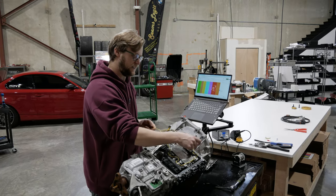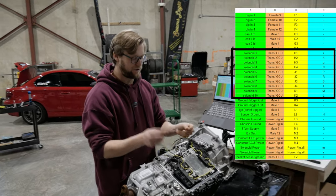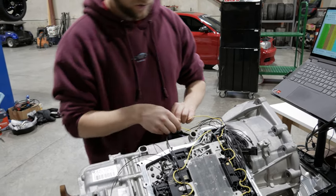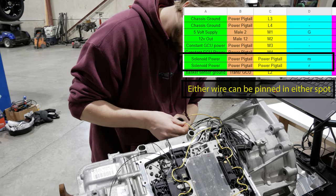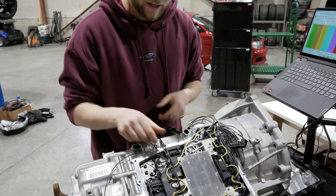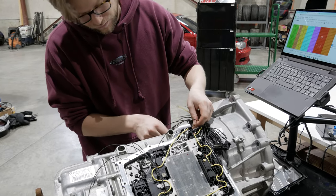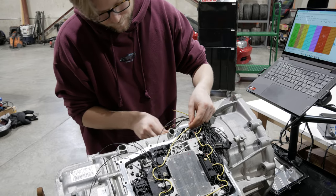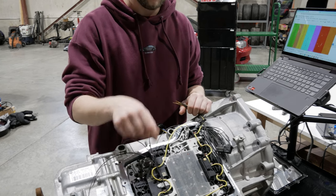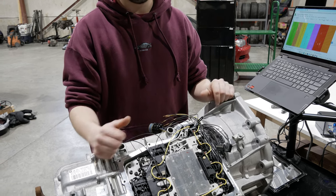Solenoids one through ten — they're marked on the sheet just like that. The first thing we're going to do is the power pins, which are these two yellow wires — they go into the center of the connector. I'm going to do the long one first and route that through to the far, kind of hidden one. Then I'll start with solenoid one, which is marked lowercase i on the sheet. Then I'll fast forward and just go solenoid two, solenoid three, solenoid four, and all the way down the line. Then I'm going to go ahead and double check it all, and then we'll do the final assembly.